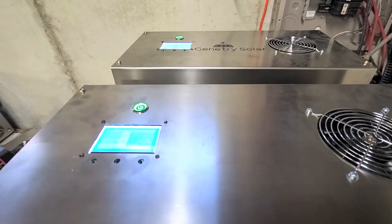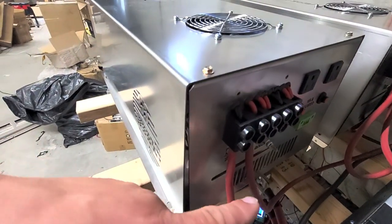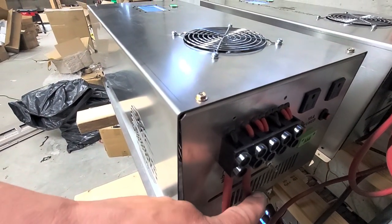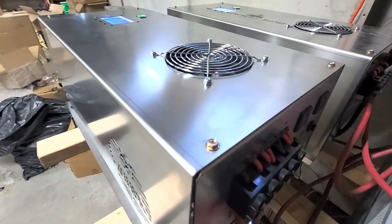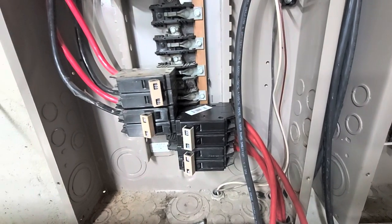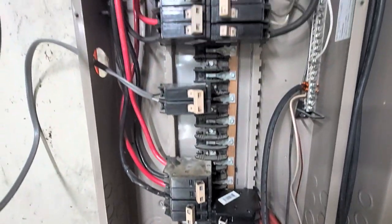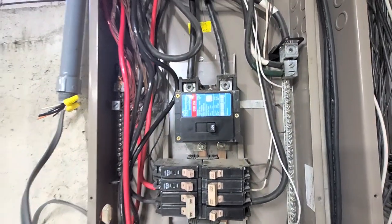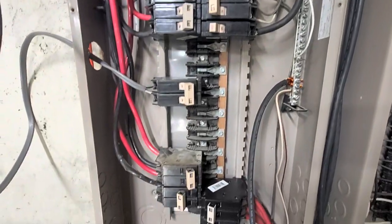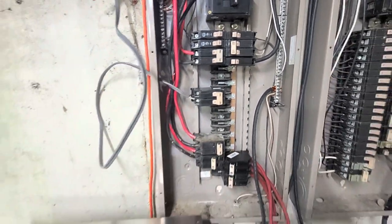This is good news. These two inverters are in fact running in parallel mode. You've got the slave inverter with the two inputs running from the master inverter outputs, and they are being combined at the breaker panel. Master is on top, slave is on bottom, and they are running this panel here — which is off from the mains. It is running this whole panel: well pump, central air, basement lights, et cetera.